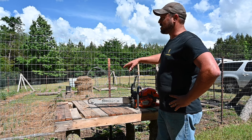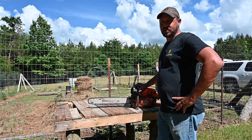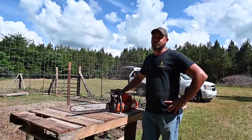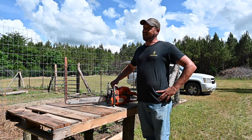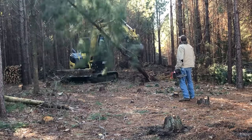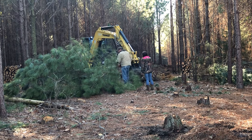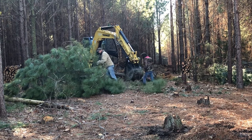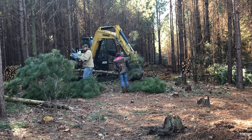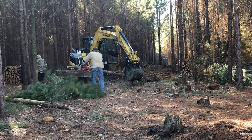After I got to cutting the garden posts and these posts here, I was getting into the hardwood and it did dull the blades out because it just had a lot of hours on it and it was overheating a little bit. That's the reason why the paint is off of the bar — I overheated the chain and it got the paint hot. But after I sharpened the chain up, it'll eat through hardwood no problem.